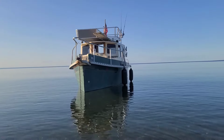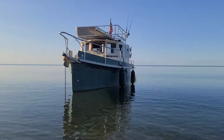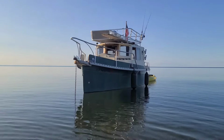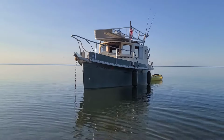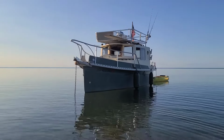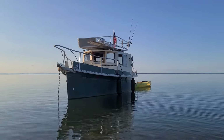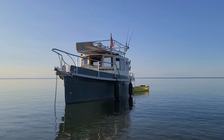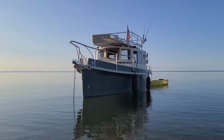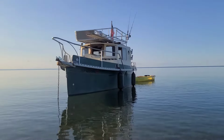It has some scuppers on the back, which, when you get rain or water in the back deck, will let it slip out. It's kind of like a self-bailing deck, sort of. But this one doesn't sit low in the water enough, or doesn't squat back enough like most boats do, to actually drain the water. One way you can get your scuppers to drain is to open up the motor and go a little faster and get the boat to tip up in the front a little bit. But this one, you've got to go almost full throttle to get it to start draining out of the scuppers. So I guess what I'm saying in 5 or 6 different ways in this video is that this boat really does need more horsepower. But the 20 gets the job done.